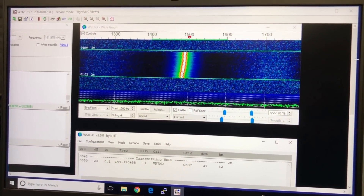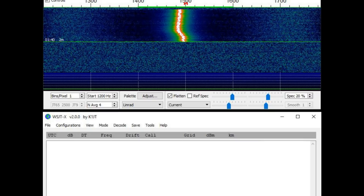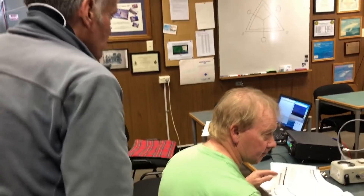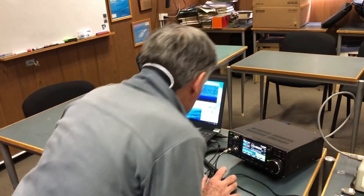The fan was running and that is what changes the temperature of the oscillator and causes the drift. What we're now going to do is start transmitting at 100% duty cycle — can you transmit at 100%? Yes. We'll transmit at 100% so hopefully the fan will run all the time and we'll start to get it to decode.